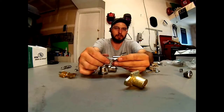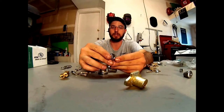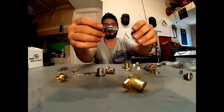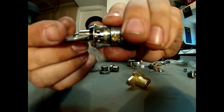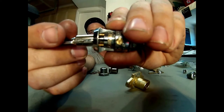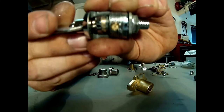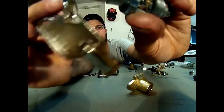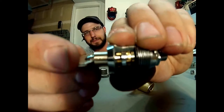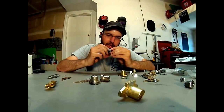The tubular picks have little success with these, and drilling them out is quite difficult if you don't have the correct tools. So that's the ACE2 tubular lock. I've got a cutaway here so you can actually see how that works. Basically your pins are in here and they align with the shear line that's actually lateral. You insert the key in and press down and it releases those pins. You can see right there what you're trying to do — when you're trying to pick this, you're trying to get the shear line with all these pins in here. It's pretty difficult to do with the newer ones. This one right here is just a cutaway, so it does not have any security pins in it.